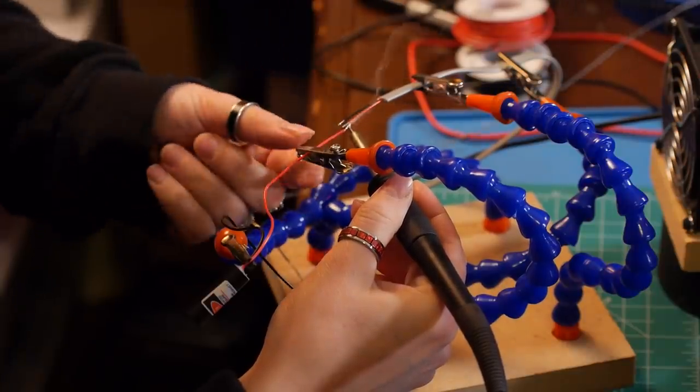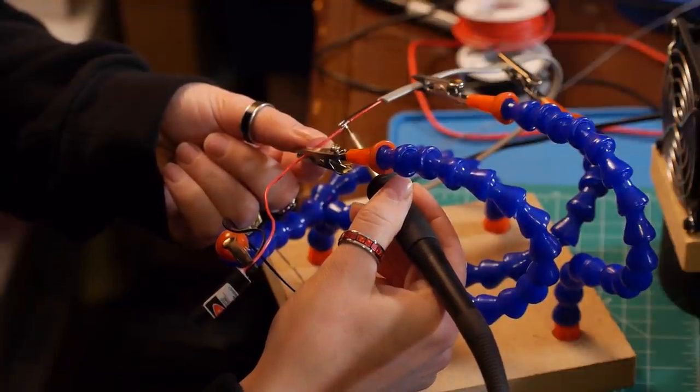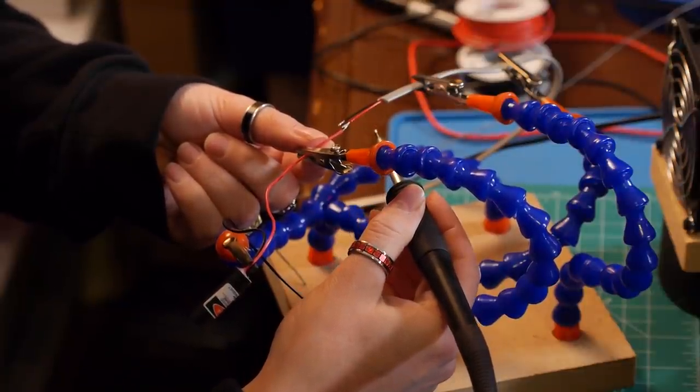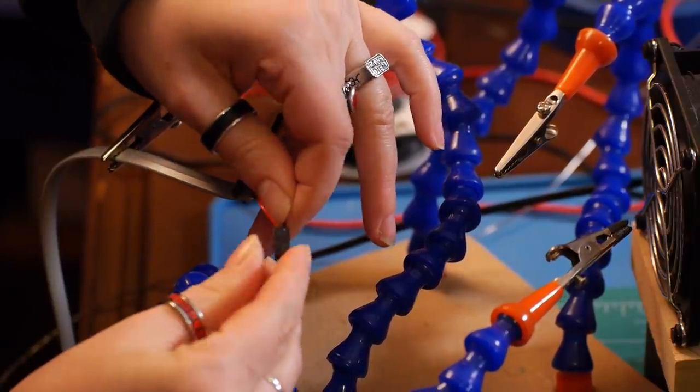Okay, now to solder all the spaghetti to all the bits. Since the laser and LDR will need to be positioned so they can point at each other and cast the beam across whatever barrier is being guarded, the laser and LDR will need to have fairly long wires. The other end of those wires each gets a plug.